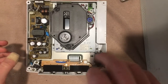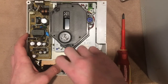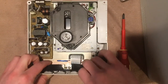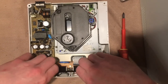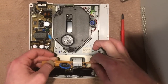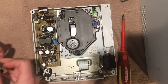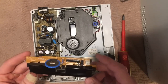To remove the controller board, it's just four screws. There's also a ribbon connector and a power connector on the side. Disconnect the ribbon connector by pulling it straight up, then the controller board lifts straight up and you unhook it from the front face. The power connector you just pull off. Now we have the board we're going to be working on.